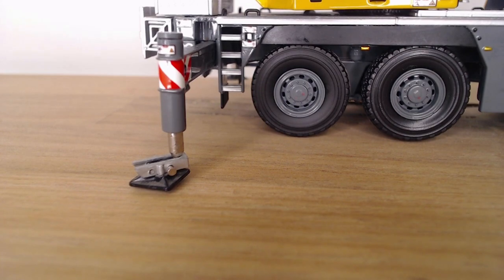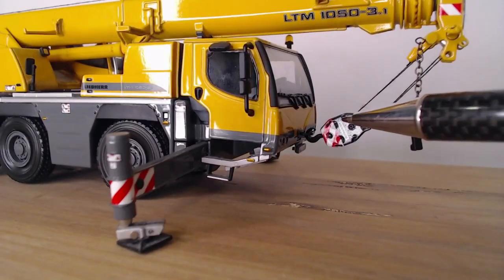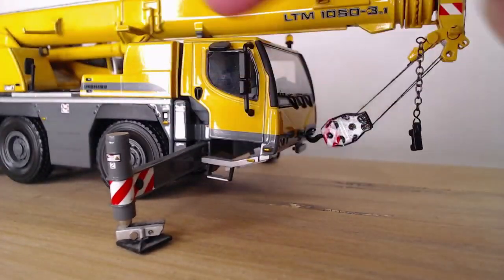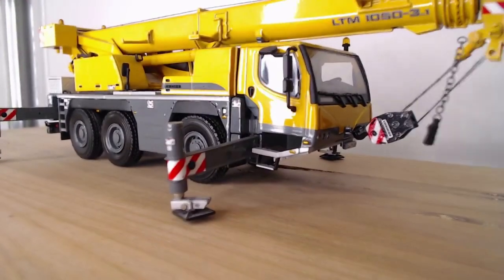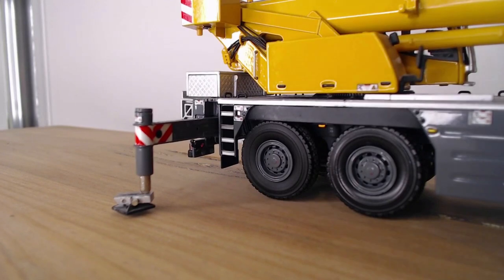You can do this very quickly, like you can jump out of this cab here, undo that boat winch, undo that pin, walk down the end, undo that pin, walk down the end, undo that pin, go around the other side, undo that outrigger pin, and then go to the front if the crane operator hasn't done it already. And bang, bang, bang, you've done five things that most guys don't do, and they're just standing there, you know what I mean?